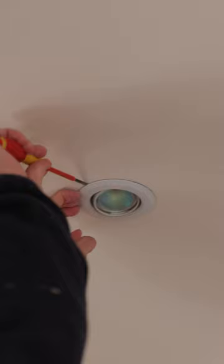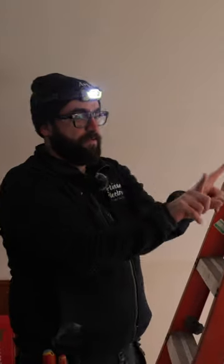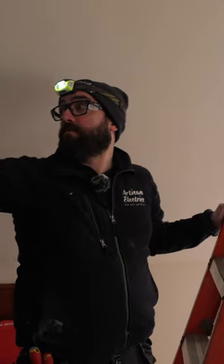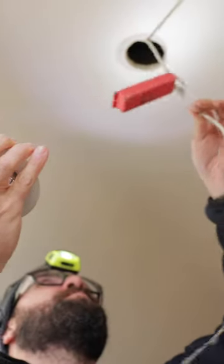These lights have a fault on them as well as the other side. So what I'm hoping to do is separate this and then we'll have two legs — one going back to the fuse board, one going on to the rest of the lights. What I'm hoping is one has a fault on it and the other one goes clear.